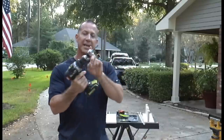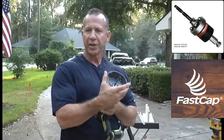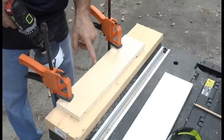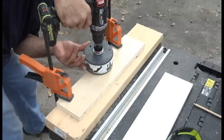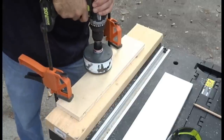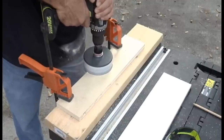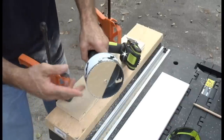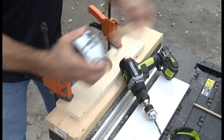I'm also using a mandrel — both of these will be in the description box. This FastCap mandrel is the best I've ever used. All you do is take your hole saw, push it down, and turn it one quarter turn to the left, and it locks in place. I want to set it as close as possible to the edge because I want the widest part — I don't want it to come down too narrow. Watch how easy it is to remove: just turn it and it pops out.